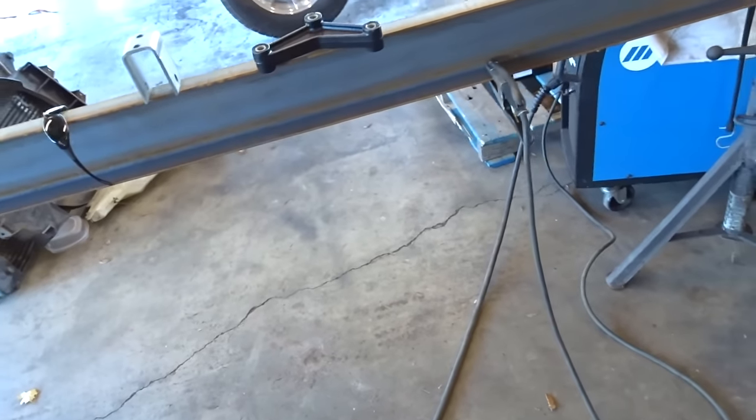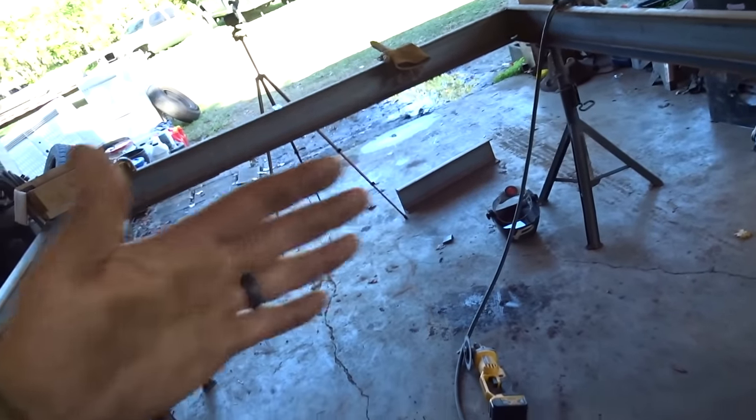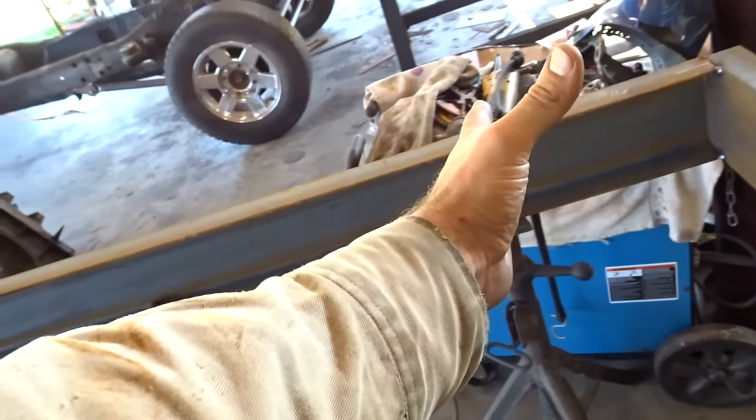And if you guys don't know, you're supposed to have 60% of your load in front of the axle. So we're gonna have a 12-foot trailer. So figure from here to 12 foot, 60%. I'm not even gonna try to attempt the math on camera. We're probably gonna move this back as far as we can. The longer the trailer is, the easier it is to maneuver. Yes, it's obviously a longer turning radius, but it's a lot easier to back up. You have a lot less pivot in the trailer. So anyhow, we're probably gonna move it back a bunch.